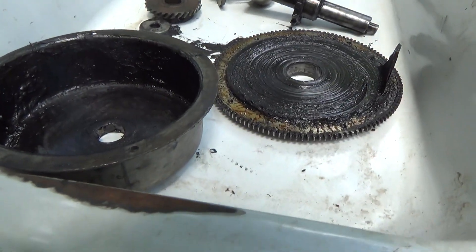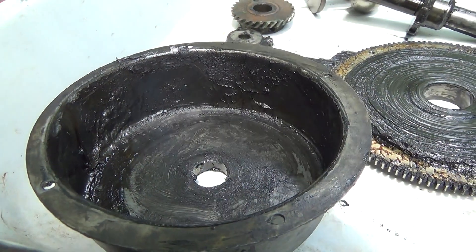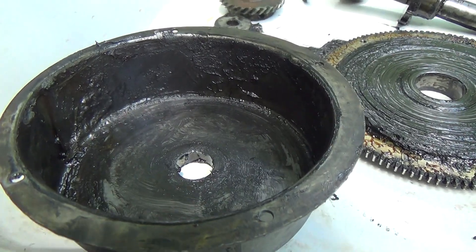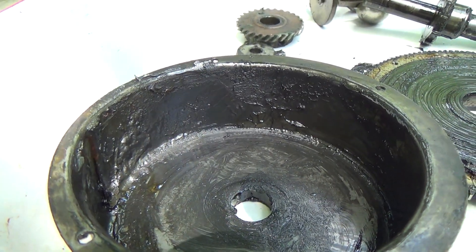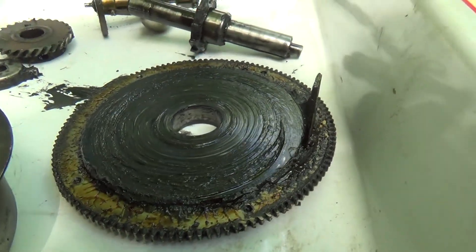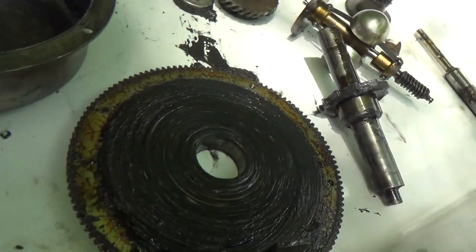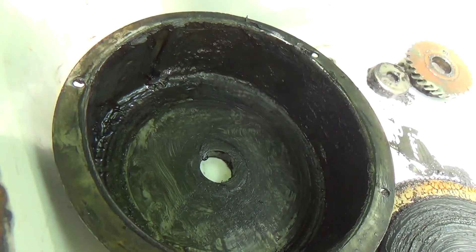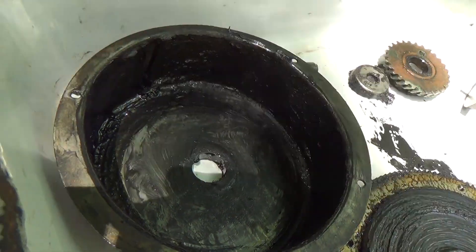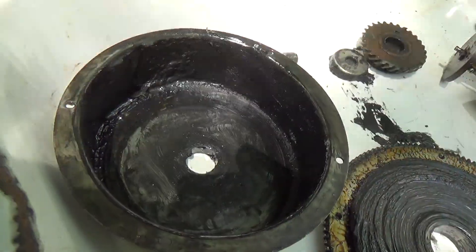I cannot think of an easier spring than this one. There are no little rivets in there that you have to hook an eye onto before you can start winding the spring in. There isn't even a little folded piece of metal that a hooked spring would hook into. What this has is a little ear that comes off of the top of the barrel, and that catches the hook. So all you have to do is wind the spring in there, making sure it's going in the right direction. You can accidentally wind it in the wrong direction if you're not paying attention — don't do that.